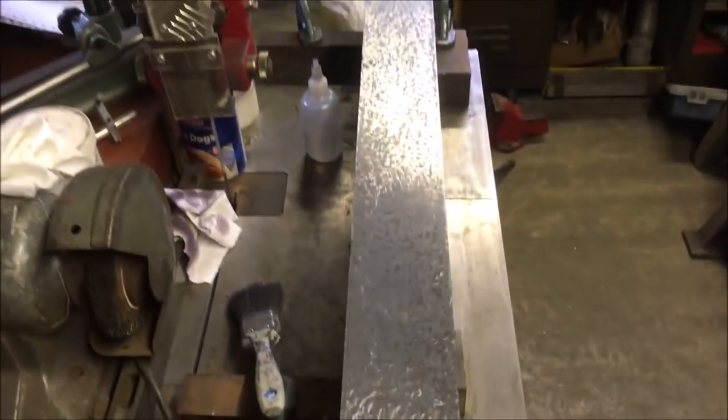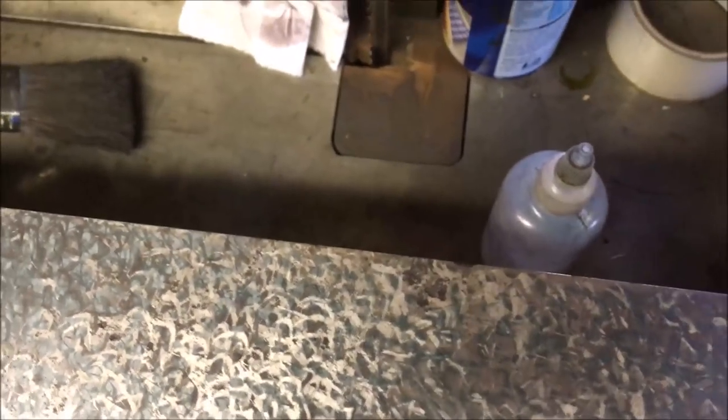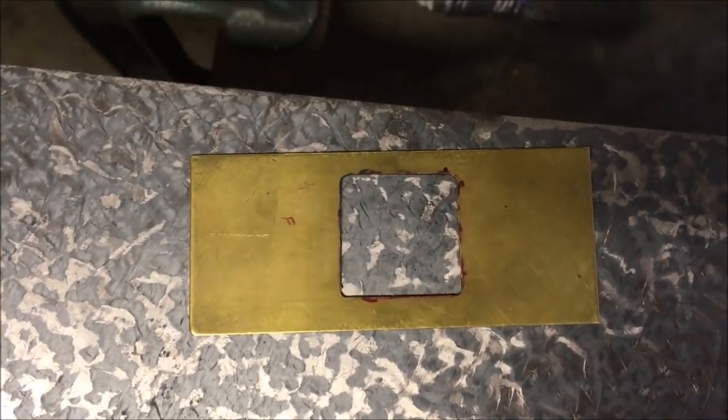But bear in mind, it's not a bearing surface, it's a standard. Now, I know that the likes of Richard King state you want something in the region of, I think it's 35 points per inch. And yeah, if I was going to make this the final surface, yeah, that one. I don't even know how you'd count that.